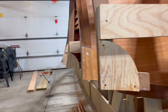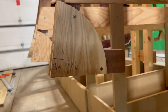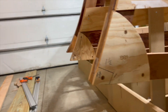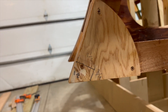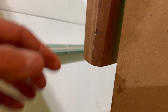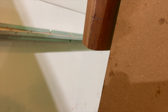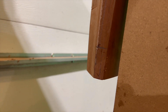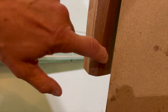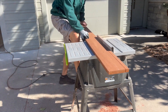At frame 13, frame 12, frame 11, 10 — frame 9 is the angled seat, we'll work on that one later. Frame 8, frame 7, 6, 5, 4, 3, 2. Here up at the stem it's going to be one and three quarter inches tall, but because of the flex back I have, I think I'm going to have this sheer clamp not only connect to the side but to the back of the stem.